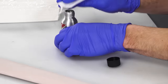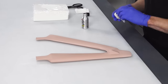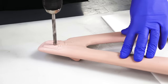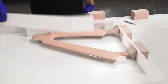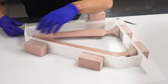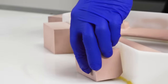I'm now sealing the pattern with a few applications of S120. This isn't strictly necessary — you would get a release directly from the model board — but sealing the surface will give a smoother, slightly more glossy finish. To attach the funnels I'm using some superglue, which makes a great job of bonding model board. The pattern needs to be suspended securely, so I'm drilling and dowelling it to provide additional support. Hot melt glue is then used to attach the pattern to the baseboard, then the barriers can be formed and positioned. As the weight of the silicone will apply pressure to the barriers, I'm adding blocks to buttress them at regular intervals. A few spots of glue tack it together before fully sealing all the joints.